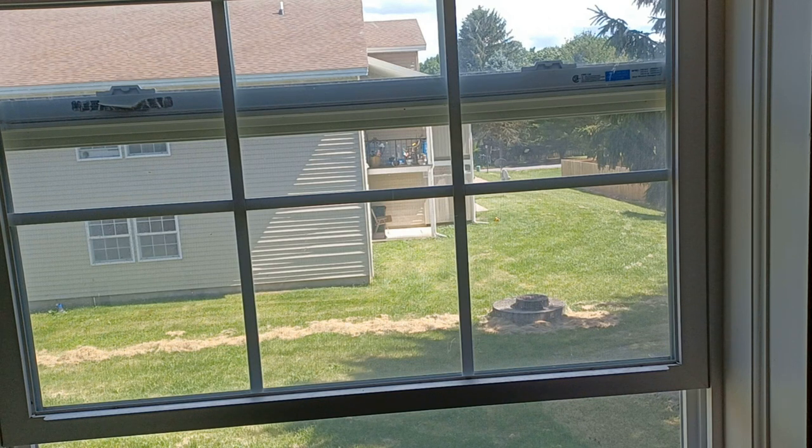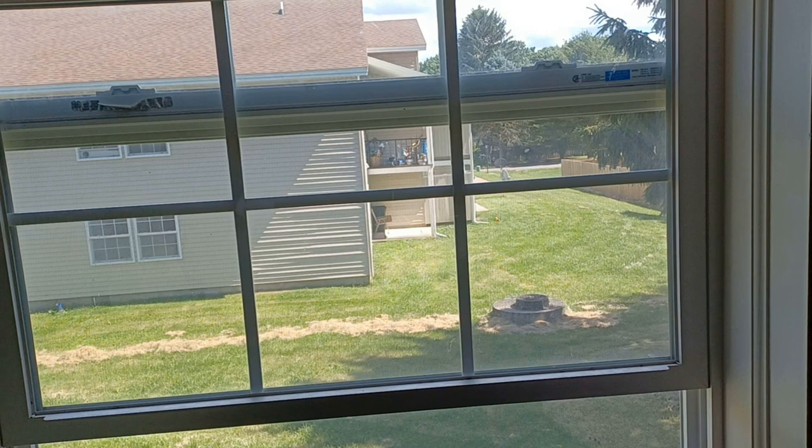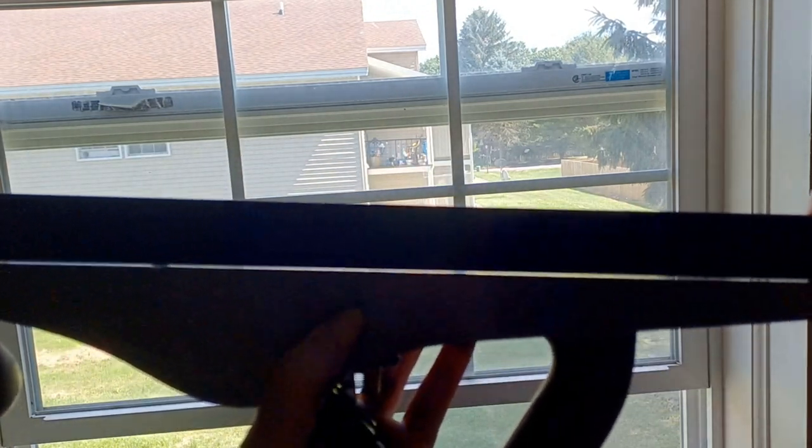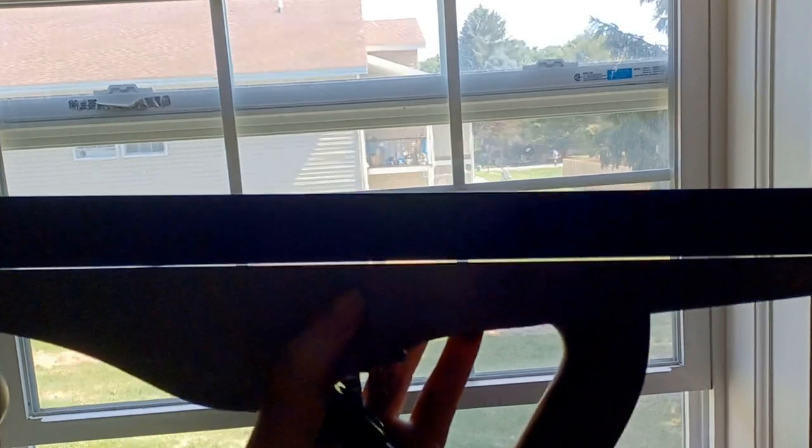It's way too long past returning it, because I've sharpened the blade, worked on the frog, cleaned up the seats on the frog and all that stuff. And I finally get to the last thing to check, which should have been the first — to check the straightness of the plane. Whenever you get a new plane, that should be the first thing you check.